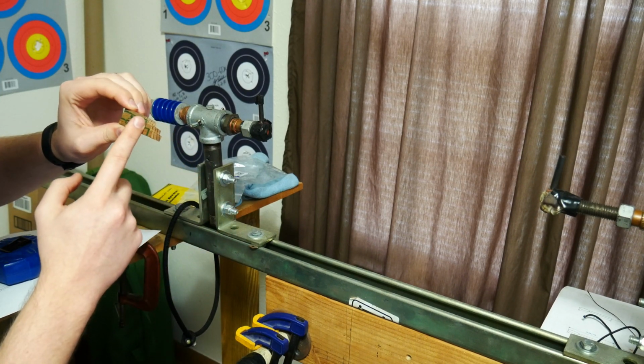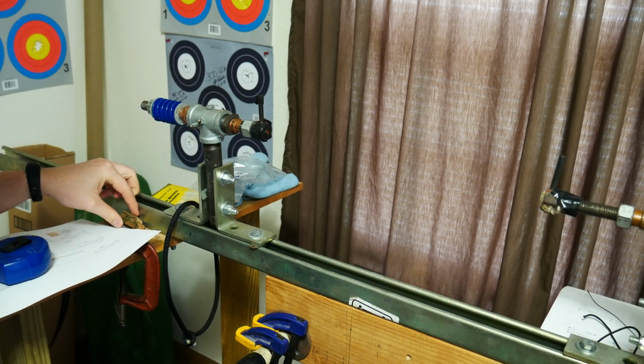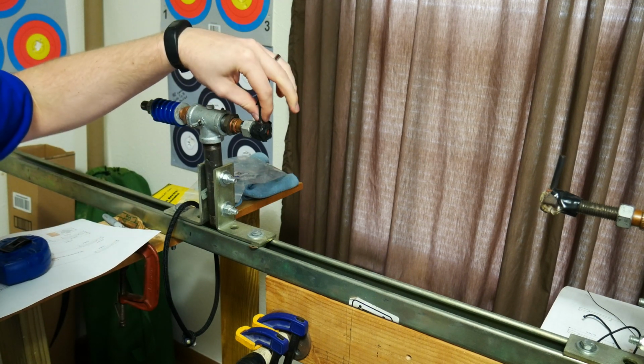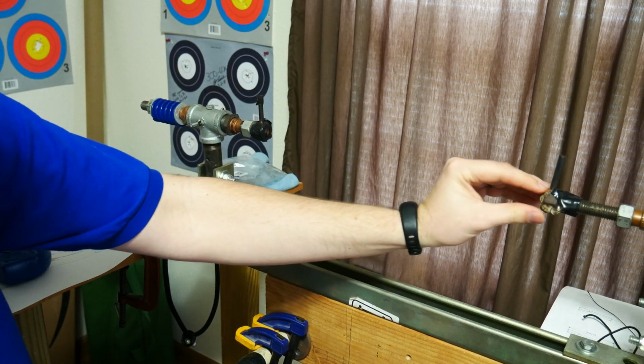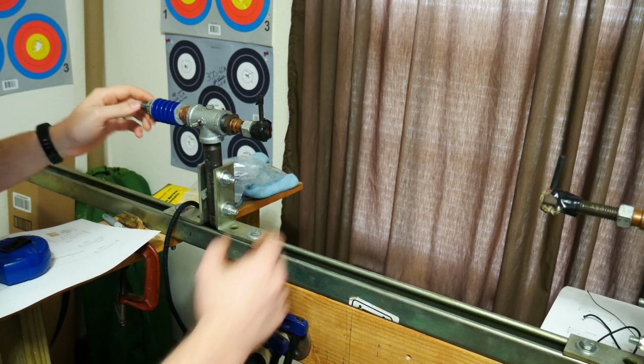I've got it cut at 300 pounds, 350 pounds, and 100 pounds. And so I know where I'm at as far as tension wise. These are just 1/4 inch roll pins. They go in holes that I drilled and tapped into some nuts on the end of these threaded rods.